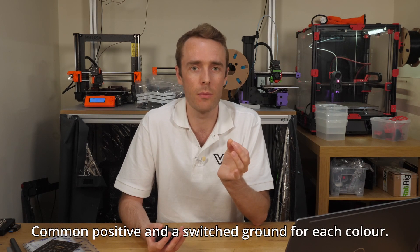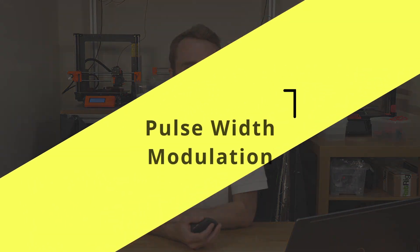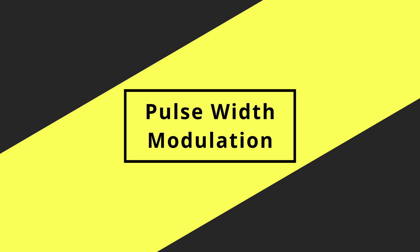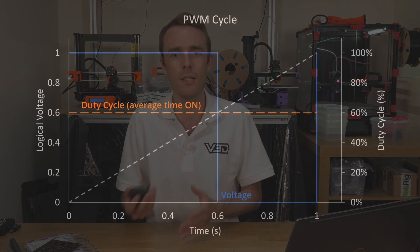The final type is a four-pin RGB strip, which is basically analog RGB. It has quite a big downside for more advanced flashy applications in that the LEDs are not individually addressable. The other thing to mention is PWM. Since LEDs need a certain voltage to operate, we can't really adjust voltage to control brightness. Instead we flash them on and off quickly, and our persistence of vision smooths this out to form a uniform brightness — this is what we call PWM.